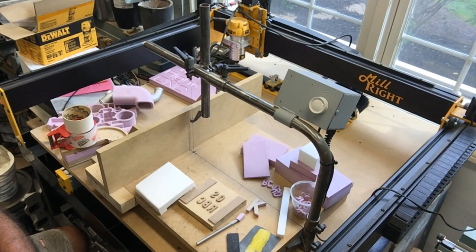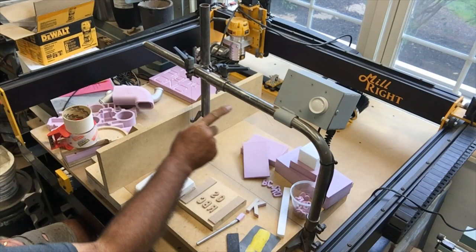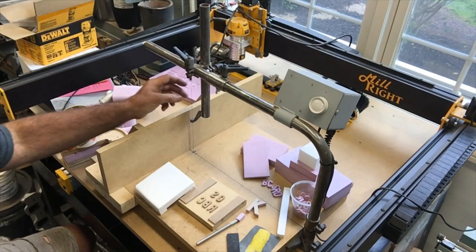The first thing I'd highly recommend if you're going to do lost foam casting is to build a hot wire cutter. They're really easy to build and you'd be surprised what you can do with them. This is my hot wire cutter here. If you search hot wire foam cutter, you'll find a million YouTube videos. There are good suppliers for nichrome wire. All this is is a transformer and a dimmer switch. The dimmer switch varies the voltage on the 110-volt supply, which gets stepped down through the transformer. There's a piece of nichrome wire stretched and tensioned underneath with a spring, and the voltage and current through that thin wire heats it to a temperature that allows it to cut foam.